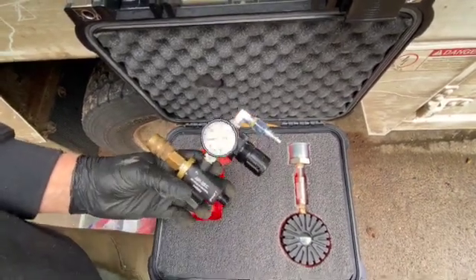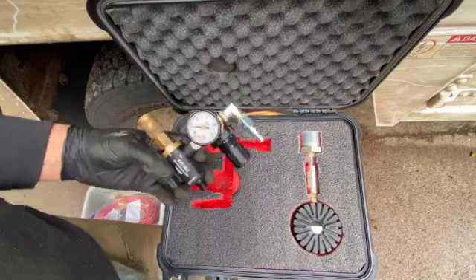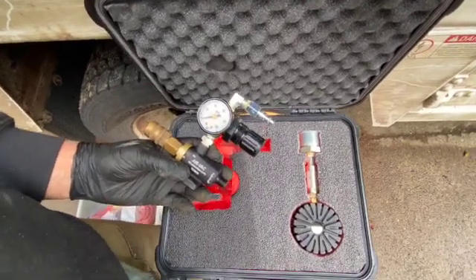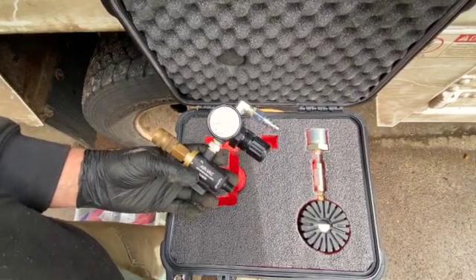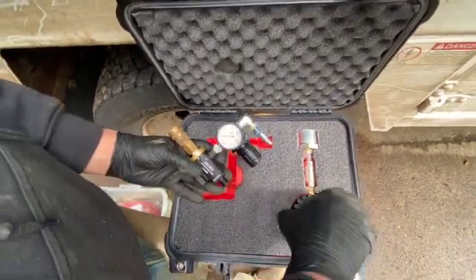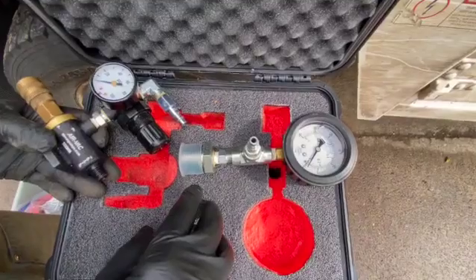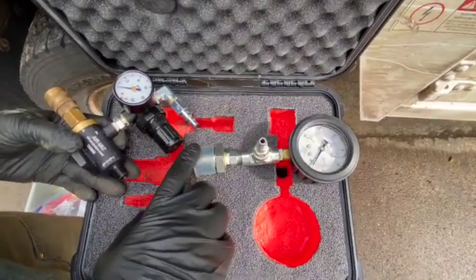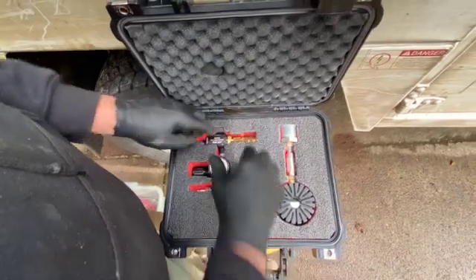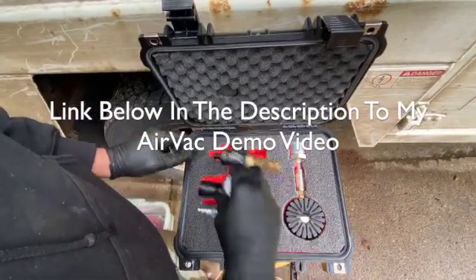This is the vent, this is the inlet, and this is the connection to your tank, so you can throw a vacuum on a tank in case you've got to pull a big valve or multiple hoses. You can pull oil depending on location and how much you've opened up in the system. This is a vacuum gauge set up to adapt into the top of the hydraulic tank on the Tigercat. The off-road wrench has a list of five tools you should have, and this was one of them.